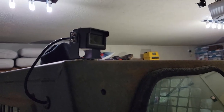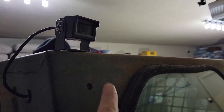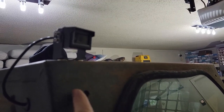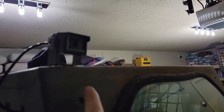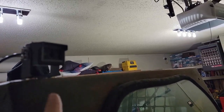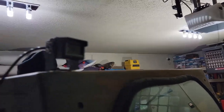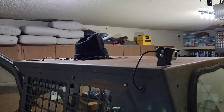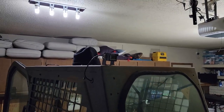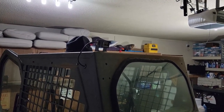I don't know what people will be putting this on — everybody's going to have a different idea where they want that camera. So I think what I'm going to do is, I don't have any angle iron right now, but I'll just grind this to get a good weld here, put a piece of angle on here sticking out like an inch and a half or so, and then move this camera down so the top of the camera is below the top of the cage. Because I do have my flashing light up there — I can unhook it and take it off — and then it gives me a little more clearance coming in and out of a garage, especially if I'm digging or using the hydro hammer and pushing the front of the cat up a little bit when I come out.